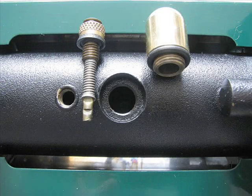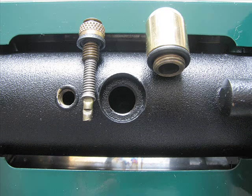So a quick look at the top of the boiler. Here is the uprated safety valve removed, and also the steam chest has been removed as well, which apparently is just purely cosmetic. However, it does give you the opportunity for another boiler insert to fit a water filler type valve, which could then have a clip-on steam chest on top of it, giving it a much more authentic look.